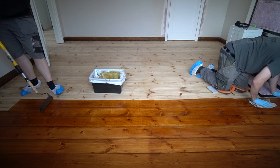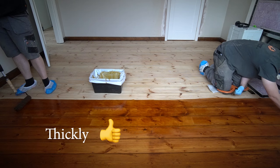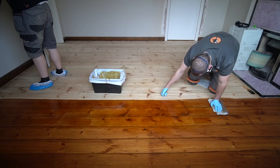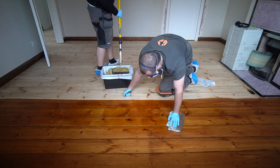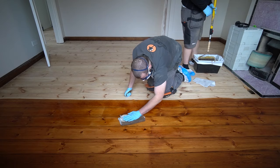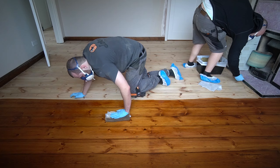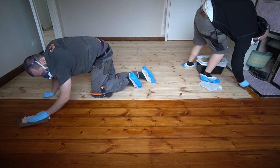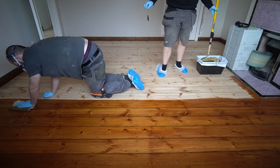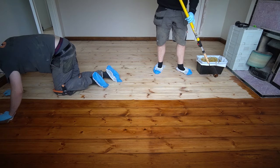Usually you use a rag to dip in the stain and apply it thickly, then use a dry rag to wipe off the excess. Using a roller like this is good for bigger areas when you really need to get it done quicker. It definitely needs to be a thin pile roller and you need to keep moving. You might notice that if you roll the roller one way it squeezes out a puddle of stain, but it doesn't if you roll it in the other direction. You can't let these puddles sit for too long — they need to be spread out. I also have a link for a short pile roller for doing the stain in both the US and UK in the description.